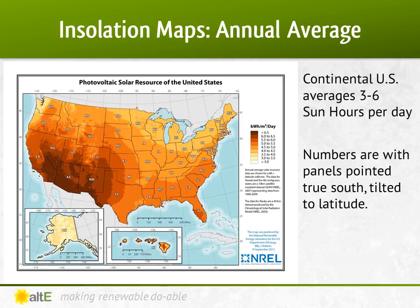Insolation, also referred to as sun hours, is not the number of hours a day that the sun is shining. It is the number of hours that the sun's intensity is equal to standard test conditions, or the brightest part of the day. For example, since the sun is twice as bright at noon as it is at 9 a.m., 9 to 10 a.m. only counts as half an hour, whereas noon to 1 p.m. would be considered a full hour. NREL also took the historical weather conditions into account for each area, so it is a pretty accurate prediction of how much sun you'll get. This is a snapshot of average annual sun hours for PV mounted at latitude tilt, which is the angle that generally gives you your best year-round performance. Here in Massachusetts, we have an annual average of about 4.5 sun hours a day.